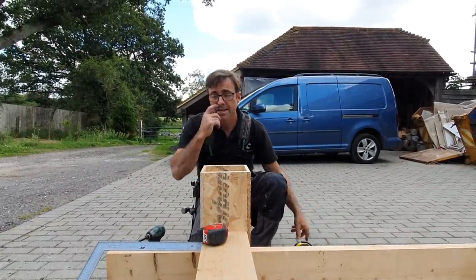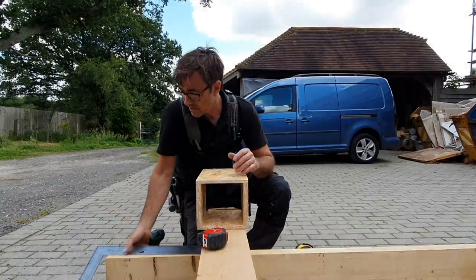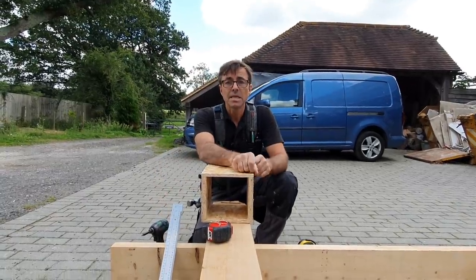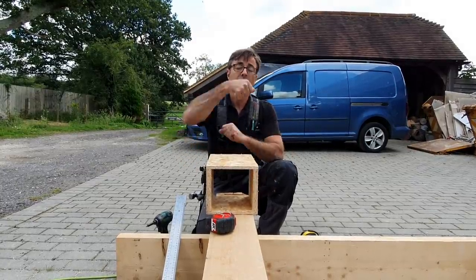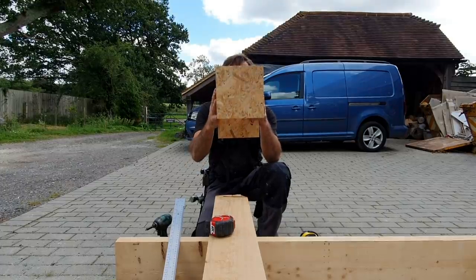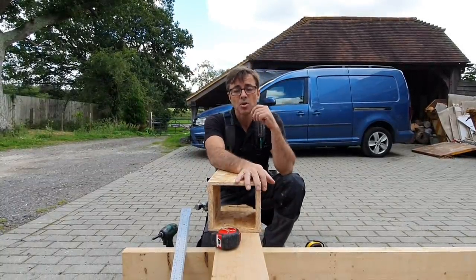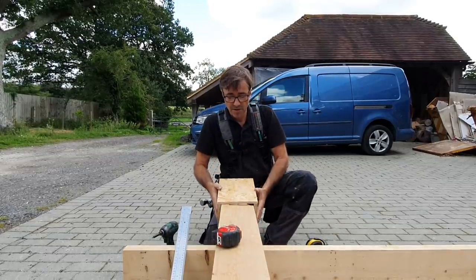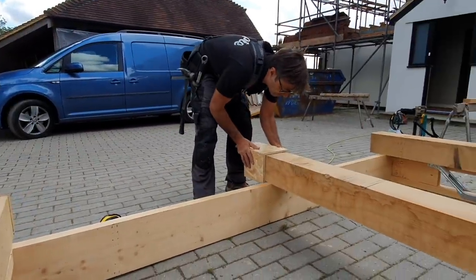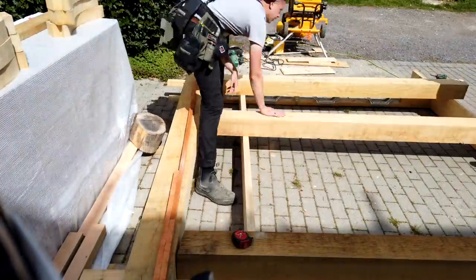So basically that is a very simple flat square shoulder box. I'm just going to slide this along, pop a clamp on, and run my saw against it — just like you see me do when I'm using a square and running the side of the circular saw. It took me 10 or 15 minutes to make this up, but it means I haven't got to do any other marking apart from clamp something on and run a circular saw around — and I know it's going to be nice and true and square. I've made it slightly bigger than the widest measurement of the post: I measured about 153 so I've made it 154, so hopefully we can just slide it on, keep one side nice and tight, clamp it on, and it will work on any of the posts.